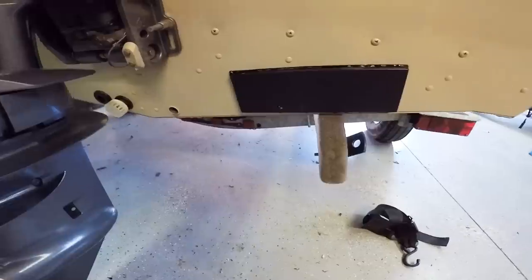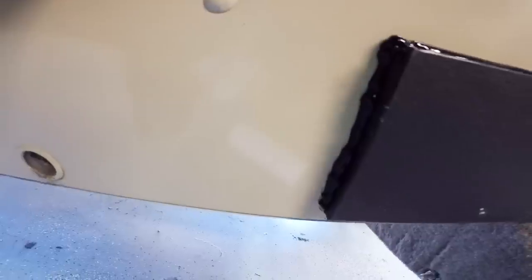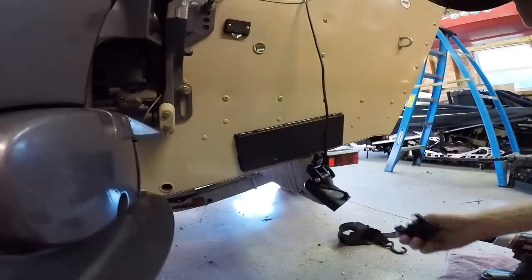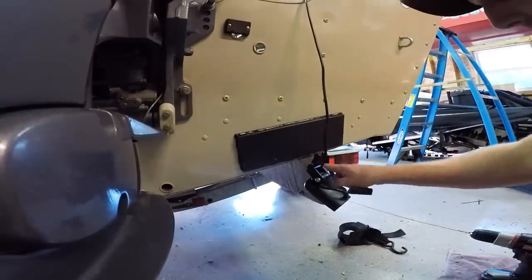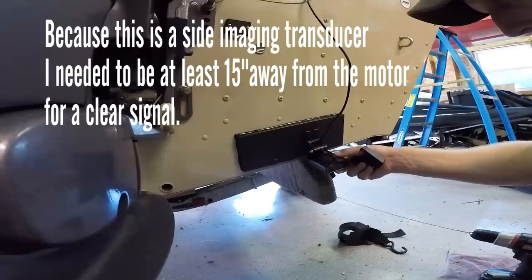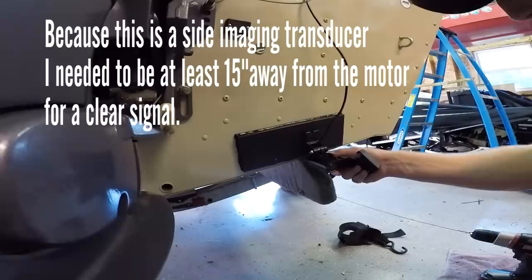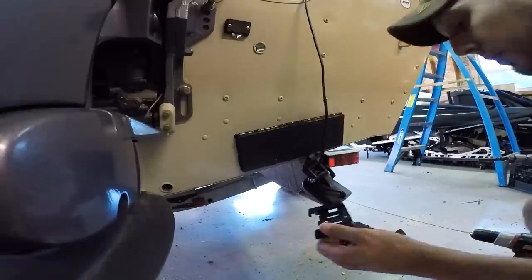I just kind of went around the edge with the silicone — that actually came out pretty good, pretty clean looking. It just filled in that top gap. Now I'll drill a couple of pilot holes and put the transducer in. I've realized that because there's a rib here and a rib there, I actually want to be right where this bunk is, which is a little unfortunate. But I'm thinking I can position it a little higher above the bunk so it won't even hit when we take the boat on and off the trailer. I can always move it around if it doesn't work.